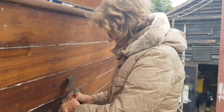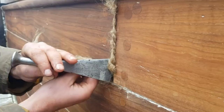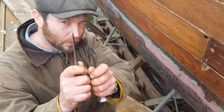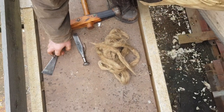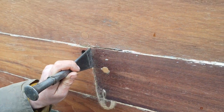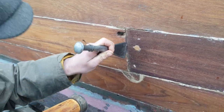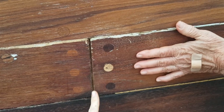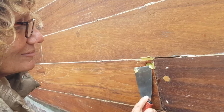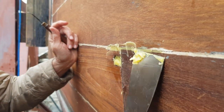What are you doing? I'm caulking. Caulking? Yeah, caulking. What does that mean? That means that this is oakum — this is the natural and original material which was pushed into the gaps between the two planks. The little bits of oakum should be completely covered with the wax.